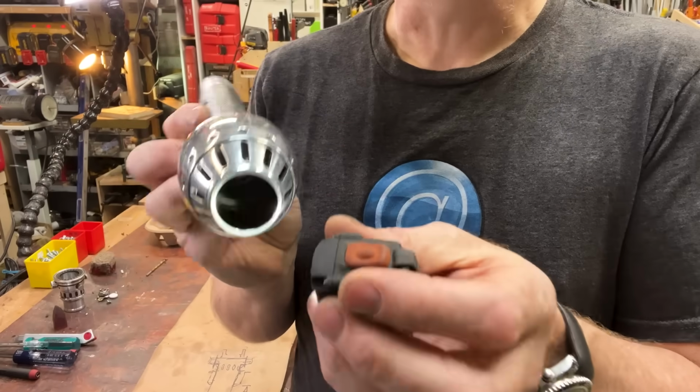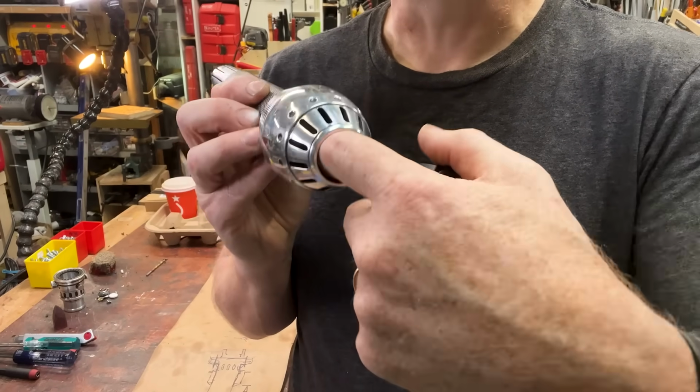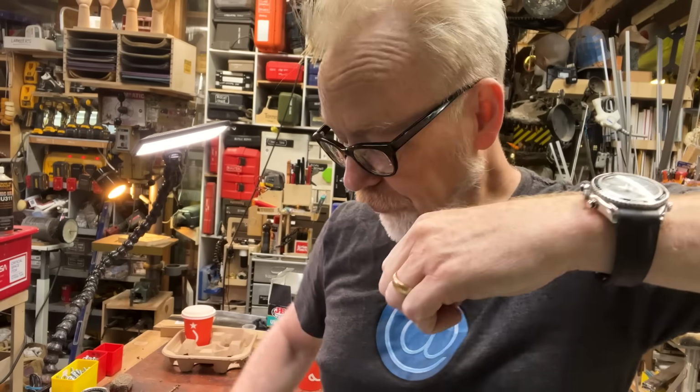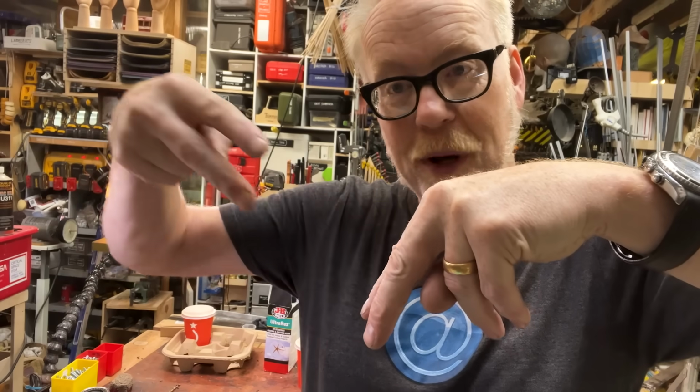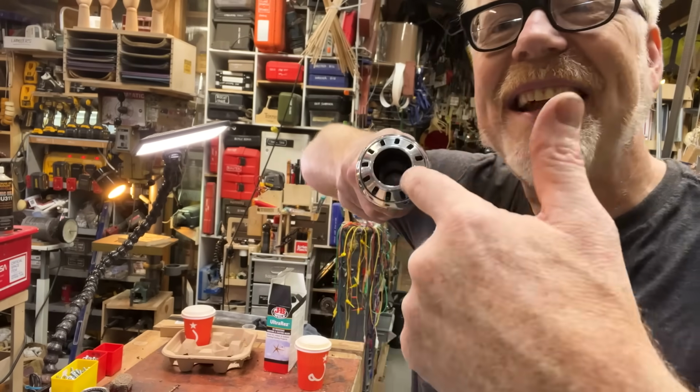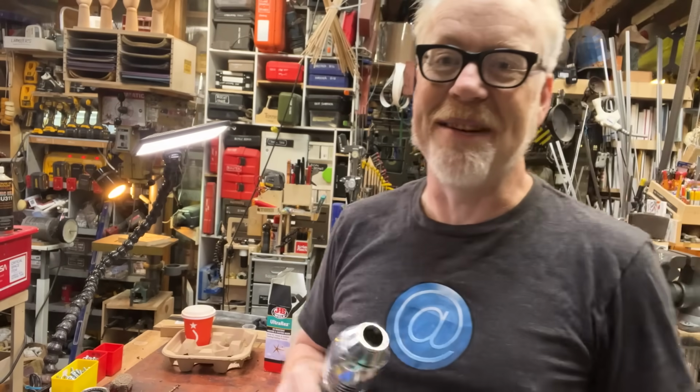What I've got to do is make a little chunky chunk of aluminum that fits on that ledge. If the ledge is like this, I need to make a piece of aluminum that fits in there. Once I get it to fit, I will drill 2 holes that are perfectly centered on the back. Then I will put the piece in there, mark it, and tap those. Once I can tap into those and hold on to that piece, so it's being held both in the angle and by 2 screws, then I chuck this in the lathe and I drill a center hole in my holder.